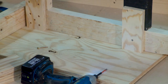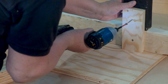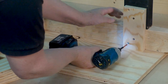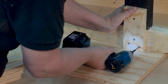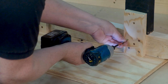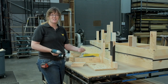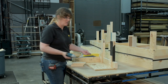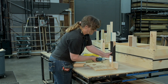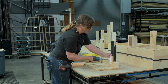Again, make sure that I'm flush with that first screw — always get that first screw flush. You can even reuse these cleats: you cut them once, you've got all the holes drilled — it's three-quarter inch plywood, it doesn't wear down as much as 1-by does. It's a reusable material. Have a bin full of these cleats and just pull them out and keep reusing them until they're totally shot.